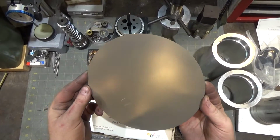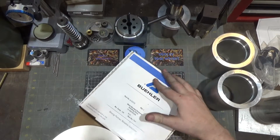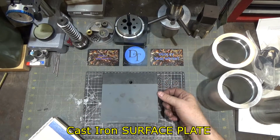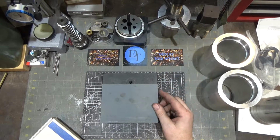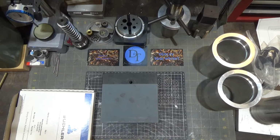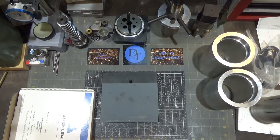So this is an electroplated diamond 15 micron. These are somewhat pricey though. So Robin Renzetti's version of this used a cast iron lap plate, because then you could come up to the edge. He'd cut it perfectly trim at the edge, and since they had square edges, you could take a part along the edge as well. Some granite blocks work that way, some don't. This was from a really inexpensive stand someone was getting rid of on eBay, and so that worked for me. I also have a little Starrett 8x12 surface plate that I have a different grit sandpaper on.